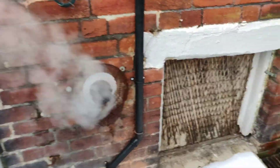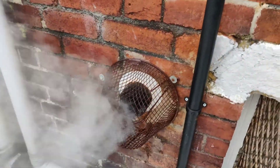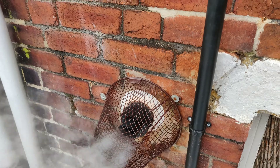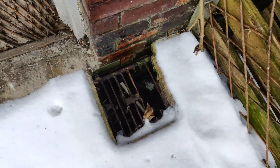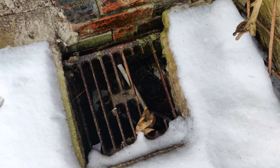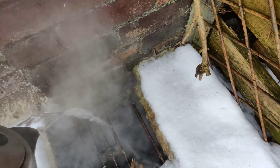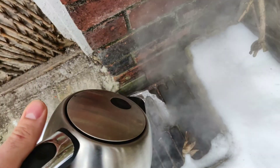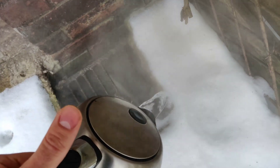So I actually poured it on before, and now my boiler's working. But you never want to pour it on this — this is called a flue, and this goes straight into your boiler, so you'll break your boiler. Essentially that white thing I showed you has come out right at the bottom, and all I did was literally just pour boiling water straight on the actual pipe, and so with that it started warming up the end, unblocking it.